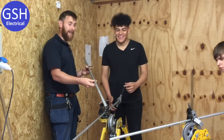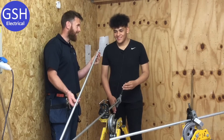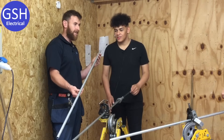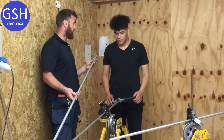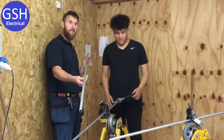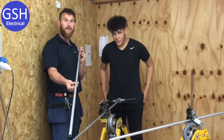Black enamel. The process of making this particular conduit — can you remember what that's called? It's called heavy gauge welded. And the other process is? Solid drawn. And where might we use solid drawn? For petrol and gases so there's no leaks. Brilliant. Can you remember what type of conductive part this is? Exposed conductive part. Callum's been with us no more than 30 minutes to an hour and already has told you several things about steel conduit.